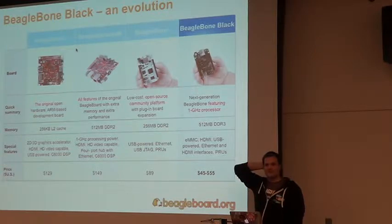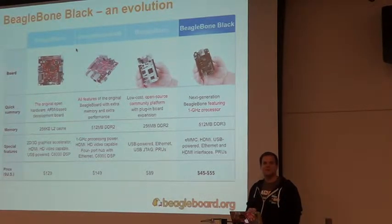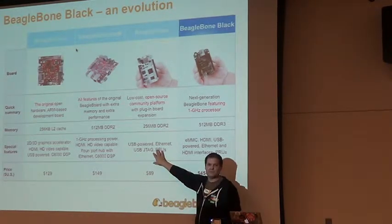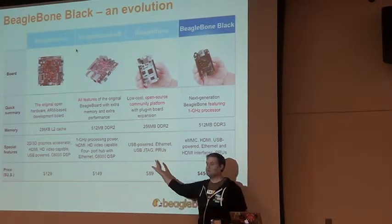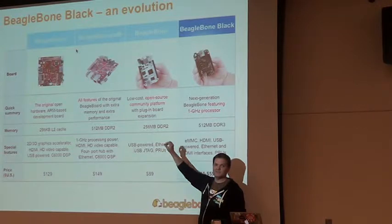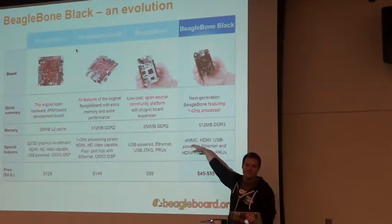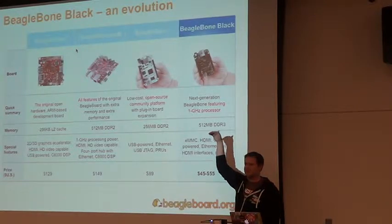The Black does have a JTAG connection but you have to solder it on the back of the board — they just removed the chip that provided a USB-to-JTAG bridge directly on board. The White also had a physical USB-to-serial so you could see the serial console log directly over that USB connection; it had a little two-port hub — one to talk to the FTDI device for serial and JTAG, the other to talk to the SoC. The Black talks straight to the chip with no hub.